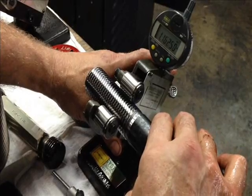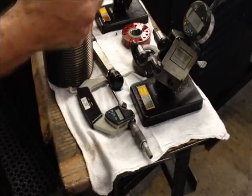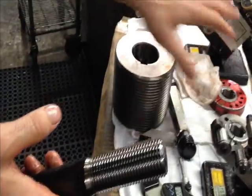We check to make sure we don't have taper — you can see it's nice and straight. This is a System 21 bolt. The acceptability criteria for it is a go gauge, a no-go gauge, and a major diameter check.